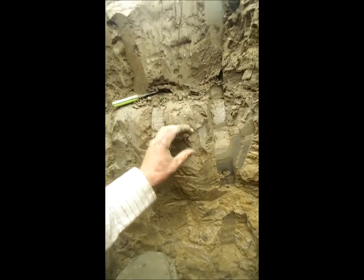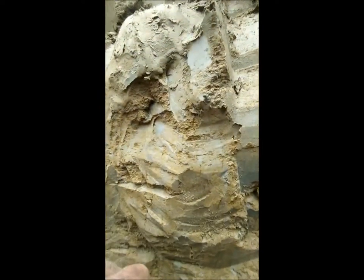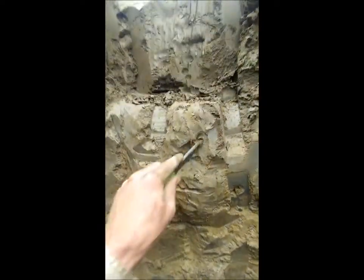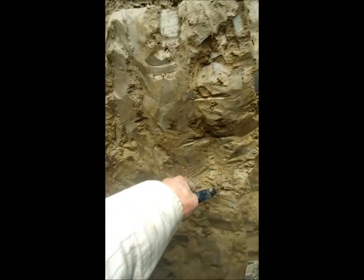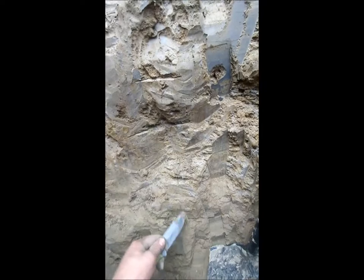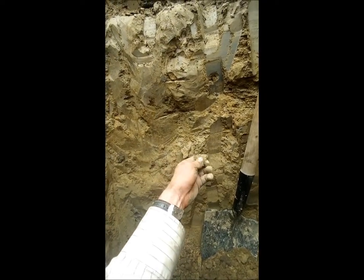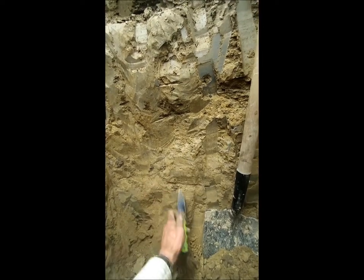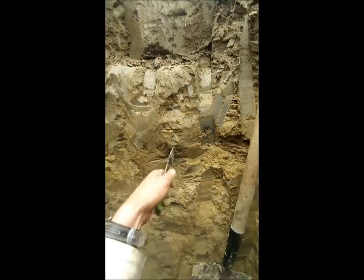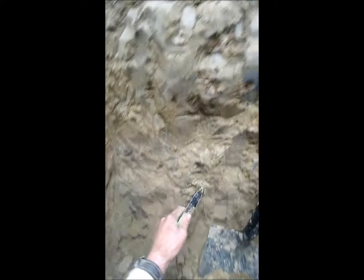This bit above the frozen layer — if you've ever taken cornstarch and mixed it with water, it becomes like a putty that if you push real slow your finger sinks, but if you push hard it's very firm. This ground is kind of like that in the spring. Some areas this is called permafrost. In this particular area you can dig down 10 or 12 feet and it'll actually be thawed, but not everywhere is like that. Every square mile you might have 10 different soil characteristics. The ground will thaw out in the spring, and the problem is when you have something heavy on it and it's oversaturated, it will actually sink. But come summer the ground dries out and it essentially quits sinking. Then winter comes, it freezes, and that repeats — every year something will sink a little more. Obviously this is a problem when you build.